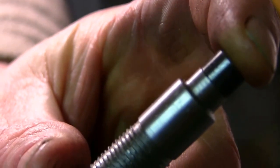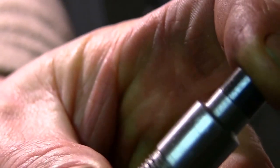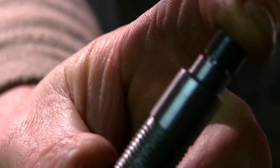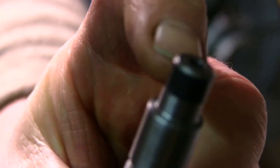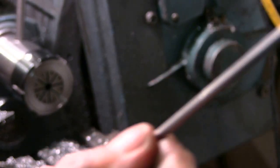Reasonably focused now. I've got the ball bearing in there — I'm going to push a pencil up the end and see how much it pops out. I reckon that should be alright. It doesn't pop out, which I don't think it's supposed to when it's in use, but the ball will hit it and it's got a little bit of movement there. Might have to adapt that — like I say I'm no expert. Drill and tap it to hold the tool bit in. That's the 4mm tool steel — that goes in there lovely, and that's what I'll make the graver end out of. That's a lovely fit.